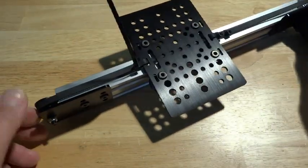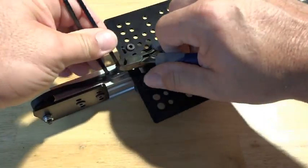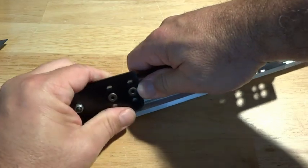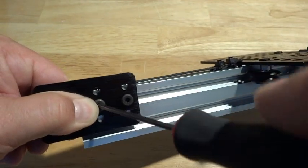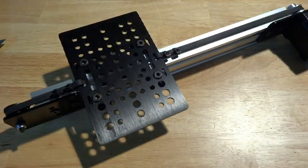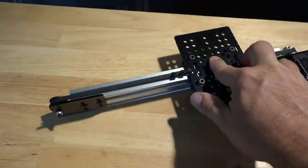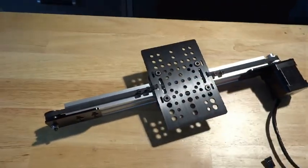I'm still a little loose back here but that's fine because we can adjust it. I'm going to loosen it up, pull it tight — pushing over and up, just grab the pulley and pull it tight. There you go — it's an awesome linear actuator! If you can't get it super tight you can always use one of the belt tensioners, but running this short it really doesn't need it. That makes a great V-slot linear actuator: super fast build, NEMA 17, nice and strong, precise, and it gives you a plate you can mount pretty much anything to. Have fun with your builds!